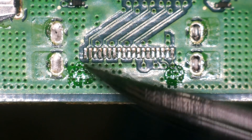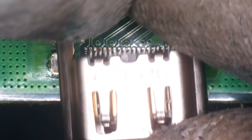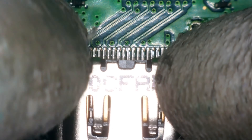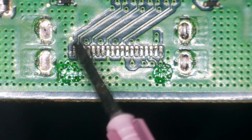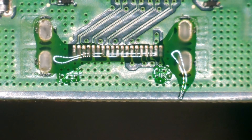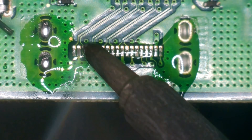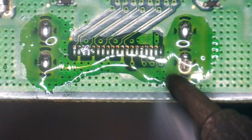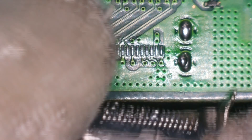Usually on PS5s I would add solder, but I actually need to check the port and make sure it lines up. I remember that with the ports I had when I did the one on this channel, it didn't line up, so I'm just going to check that now. It might actually line up perfectly — in that case we'll go ahead and get the leaded solder added. This is how the old port looked — could you see how it snapped in the middle? Coming with our flux just on the ground holes and the pads. This method works for me — feel free to use it, but it might not work for you. Let's put some leaded solder here, mixing it with the unleaded, just over these pins. Beautiful. Wipe away the excess flux. I've also tinned the port itself.